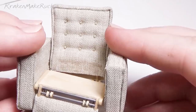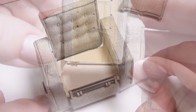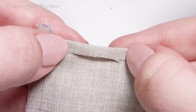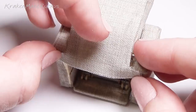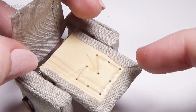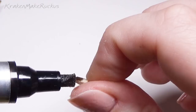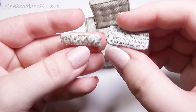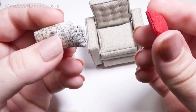Seeing it working so well was so exciting. I glued the armrest and the seat support onto the armrest. I created a fabric piece to go onto the back seat cushion like you see in most recliners, only gluing it on the top half edges and not the bottom half because you want slack when you open and close the recliner. I stained the legs and glued them on, then glued a piece of fabric to the top of the seat support so the mechanism inside is hidden. I wanted to make long throw pillows but they weren't coming out as square and crisp, so I left them out.